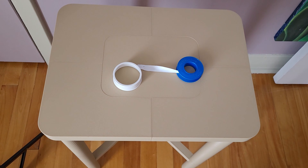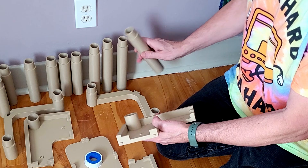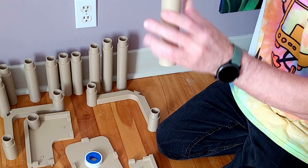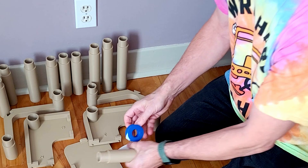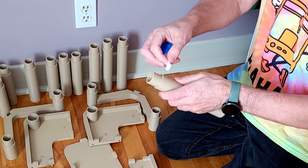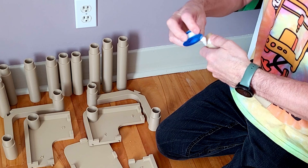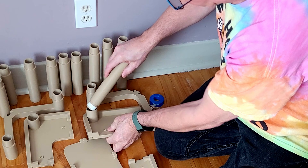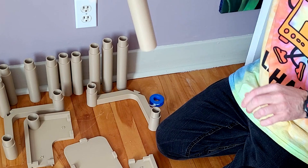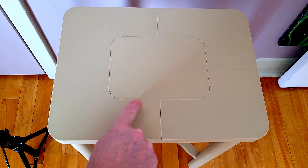Here's the one simple thing that saved the whole project. If you've got two components that are a sliding fit but they won't necessarily stay together, all you do is take a piece of Teflon tape and wrap it around the male part just to take up the little bit of slack. It doesn't take much — there's a little bit of variation in each of these — but now it stays together.